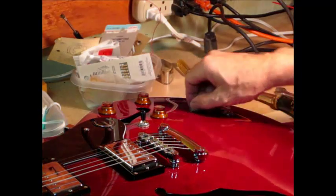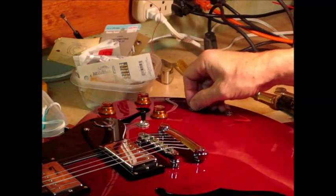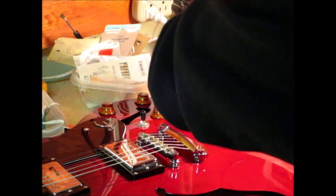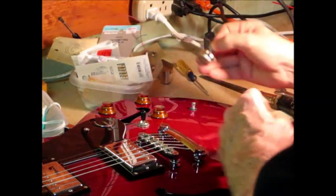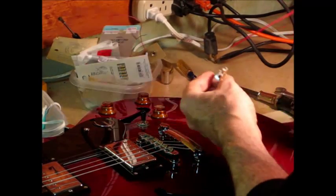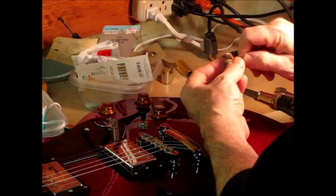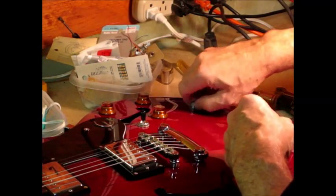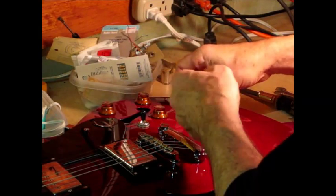So pull the nut, pull the washer, lasso the control again with the fine wire, fish it back over, get a good spray on the control. What you want to do is try to hit in here so that the tube actually makes it into the slider part, and then quickly back and forth like that. And if it's successful this time, then great. If not, we replace that control.